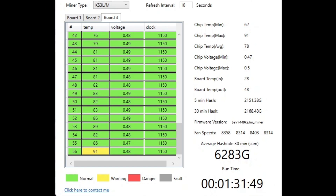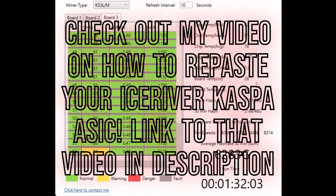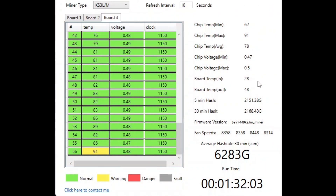The first thing I want to talk about is chip temperatures on these Ice River ASICs. These Ice Rivers have been out since June, maybe even running before that with some testing from Ice River, so they might have been running a long time before they got to you. If you've been running them for a long time, I'd highly recommend trying out this Ice River monitoring tool that T-Swift came out with — it's free. My temps aren't too bad right now because my garage is cool in winter, and my hash rate has improved: I'm getting around 6,240 gigahash on my 30-minute average. In the summertime it was more like 5,800 to 6,000, mostly in the high fives.